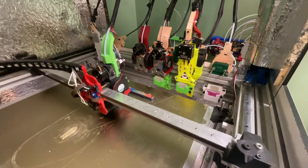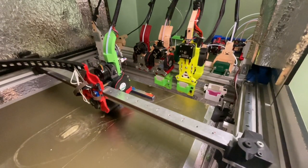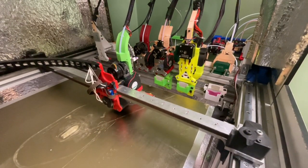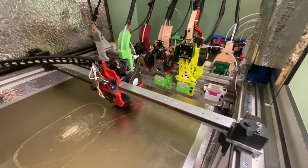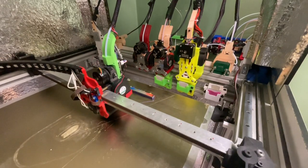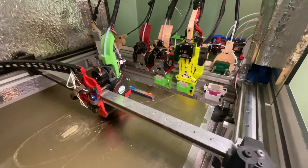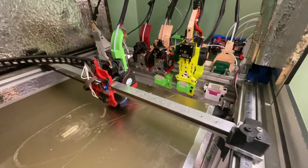Looking at the unload times that are not temperature sensitive, the mean time for unloading a real tool is about 7 to 8 seconds, while an ERCF tool takes about 35 seconds. The much longer purge of the ERCF is not included in these times and should also be considered.